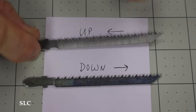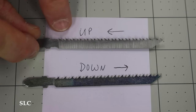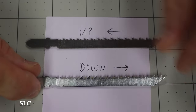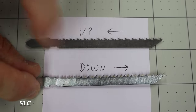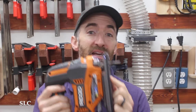This is a pretty easy swap over — it all really depends on the blade you have. Most blades you'll find will be in an upcut, just like this blade is here. But if you notice, the teeth on this one are actually opposite — this is a downward cutting blade. So if you need to cut in a downward stroke, just make sure you get the appropriate blade. Do keep in mind if you're going to be using a downward cutting blade, there's a very good chance that your jigsaw is going to want to jump up on you a lot more, so just be prepared for that.